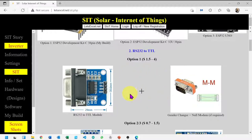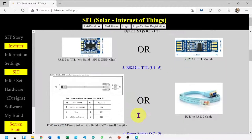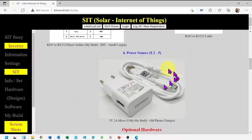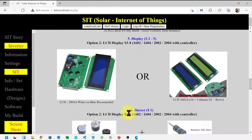Like the TTL module and other options — you can have a module with an RS232 port, or a simple module. You may need a null modem gender changer. You can use a ready-made cable or build your own; a wiring diagram is given. There is also a recommended power source section.